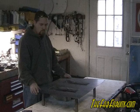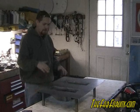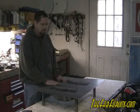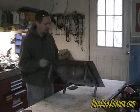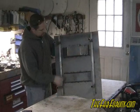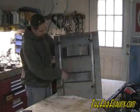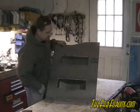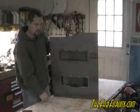Alright, we're going to jump forward a little bit. I've actually completed this — I'll just show you what I've done. I basically took the cardboard layouts we had done earlier, transferred them to sheet metal, cut them out, and bent the sheet metal up just like we did the cardboard. As you can see, it's basically the same thing we had earlier. Then I took the remaining sheet metal, traced it out, and cut it so now we have a negative piece with nice cavities in there that we'll produce our pieces out of.